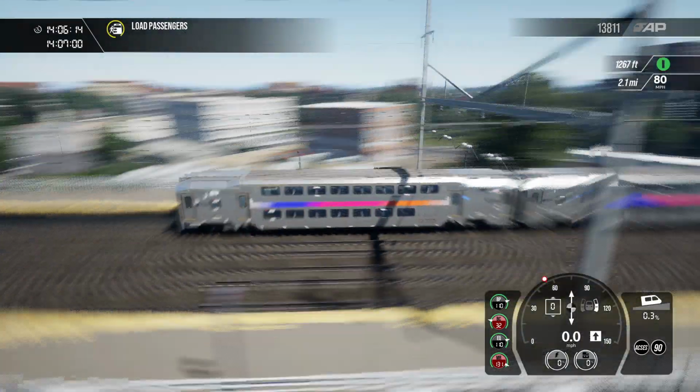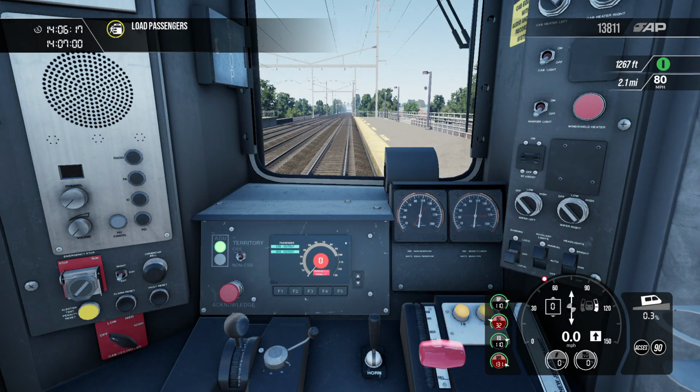Okay, while we're sitting here at Elizabeth, I'll go over North Elizabeth since it is quite soon after Elizabeth. It's only about a mile away. Typically, if you're stopping at North Elizabeth, you will have already made Elizabeth. So the stop guide says if you're stopping at North Elizabeth eastbound on track 1, apply the brakes as soon as you hit 55 miles an hour and take a 15 to 20 pound reduction and adjust as needed. Just make a note that North Elizabeth is a short platform. So that is what we will do. Close down.